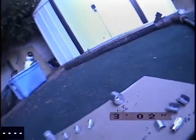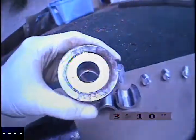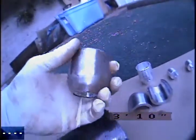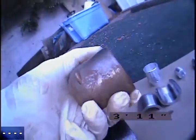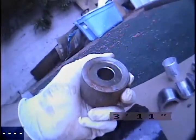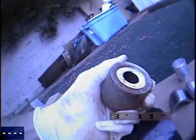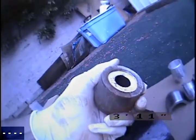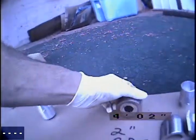We have a couple other varieties created in all different shapes and sizes. Here's the one that has a hole through the center, which we used in one of our first videos, and now we've created a steel shell for it. We actually used this — that's why it's all rusted up — to retrieve a bit that another plumbing company lost inside a main sewer line. We went down a 3-inch vent into a 4-inch cast iron main. The outside diameter of this one is 2 inches.